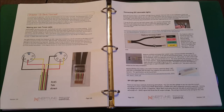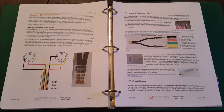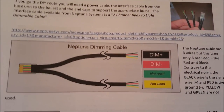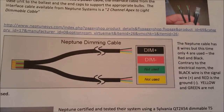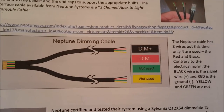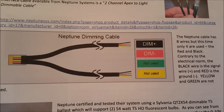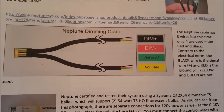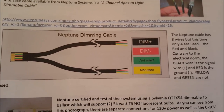the owner's manual, and there's actually some really good directions. The one thing I will note, if you look here, is that their plus and minus, their positive and negative wires are actually backwards, and they actually note that in their instructions. So we're going to be hooking up the positive to black and the negative to red, which is kind of the opposite of what we would think. And of course, what we would do with the Reef Keeper. So just make a note of that.